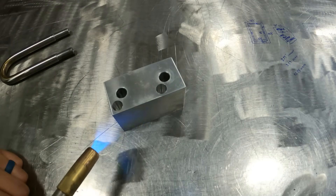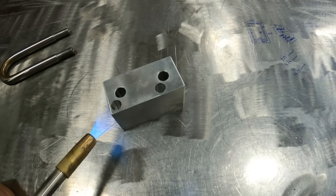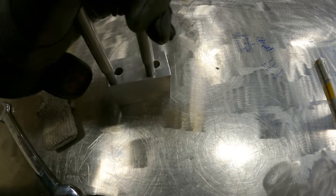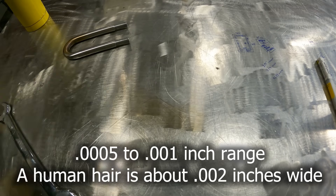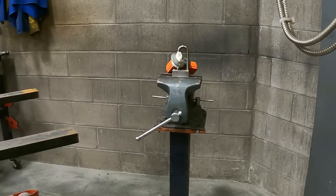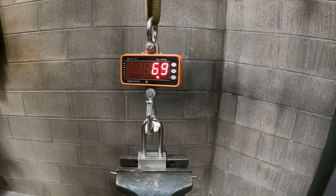To test the lock, it involved heating the lock body with a blowtorch until it reached maybe 200 to 400 degrees — with the blowtorch that takes about 30 seconds. Then I'd take the shackle and insert it. The heat makes the lock body grow a little bit, imperceptibly small, but the diameter of the holes are in the half-thou to one-thousandth range — also imperceptibly small — and that's how this lock is able to work. I was able to get the shackle in while the block was hot, and now that the block has cooled off, it is stuck. I put a crane scale on to test the pullout strength, and I'd guess the holding force is between 150 to 200 pounds — enough that you can't pull it out by hand.